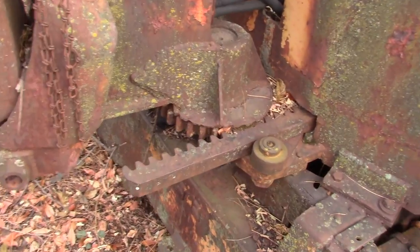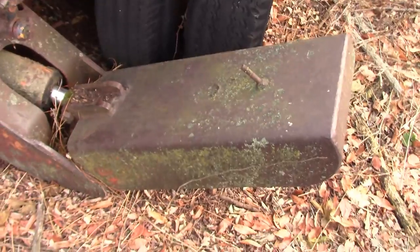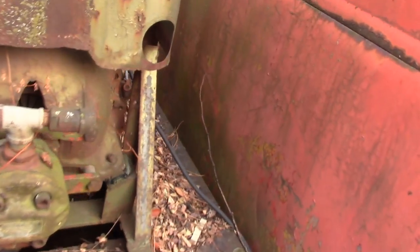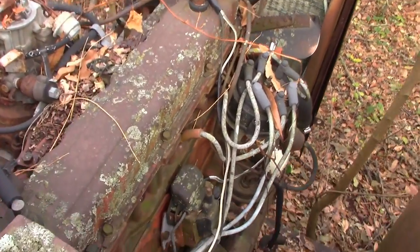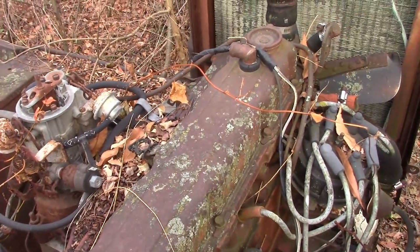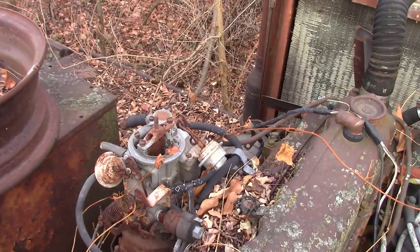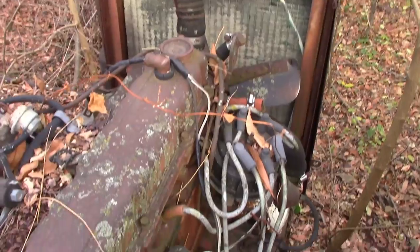It's got a crazy rack and pinion system for the swing - I don't think I've ever seen anything quite like that before. Great big outriggers on it. There's a pony motor here that runs the hydraulics. Looks to me like it was originally a Continental Red Seal power unit and somebody swapped out the original flathead Continental for this GM inline six cylinder engine. It's got HEI ignition and everything, but it's been sitting outside with the carburetor uncovered for 20-plus years. The radiator's been uncovered that whole time too - I'm sure that's frozen and blown out, so that will never run again.